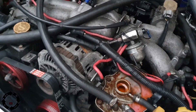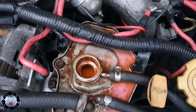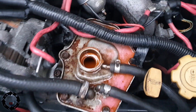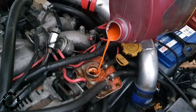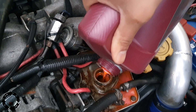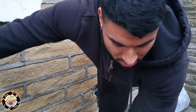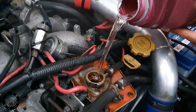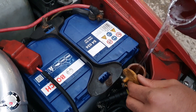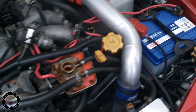It's going down — it's going to take a little while guys, airlocks always take a good while to release. You're going to have to fire it up to get it to drink. Watch — now the car is thirsty, look at it going down. You don't want that water to run out. This is the overflow — when it runs out of water from there it just sucks it from here. We'll have to get this cleaned out one day.